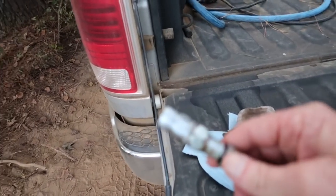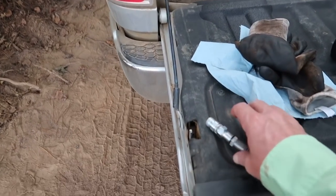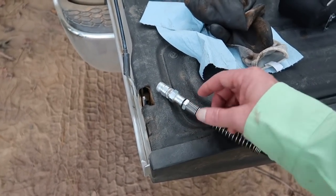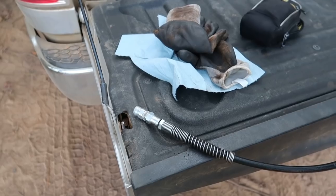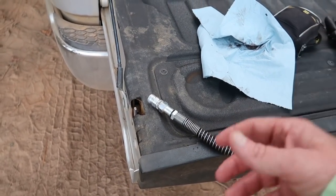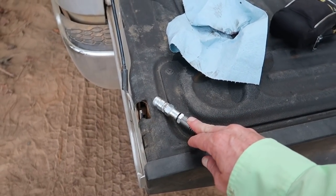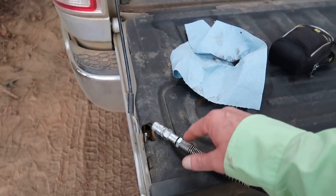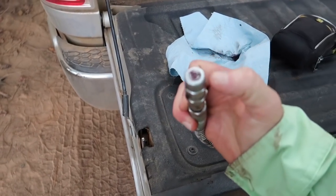In the previous video I talked about grease fitting ends. This is the one I'm currently using — it's a Lincoln end, which I like. It's a larger diameter, so it's actually a locking end, but you don't have to squeeze anything to make it lock. It's a really good end, very comparable to a locking lube. I don't like a locking lube at all because they're very messy, and having to squeeze it — I don't have time for that when I'm greasing. This one actually slows me down a little bit too. It's better than a locking lube in my opinion, but I'm still not as crazy about it as a regular one. The biggest beef I have with it is the large diameter end because of the locking mechanism.